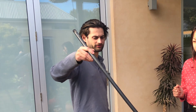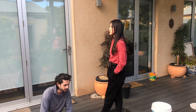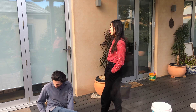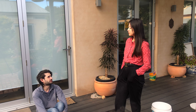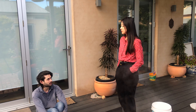What's going to happen when you introduce calcium hydroxide? It's going to form calcium silicate. Calcium silicate's melting temperature will be higher than sodium silicate, so it makes a bit of a refractory material. The reason for choosing sodium over calcium silicate is solubility — but the theory is you can add the chemicals required to create calcium silicate into the mixture, and then when you fire the furnace the reaction will occur, forming calcium silicate.